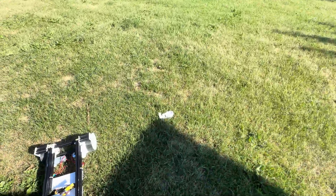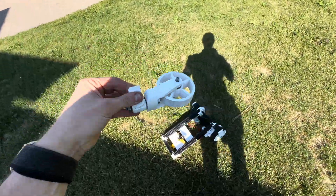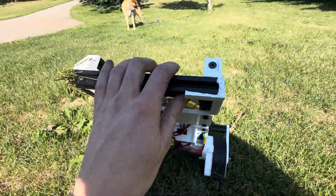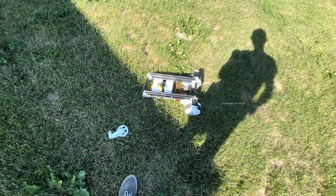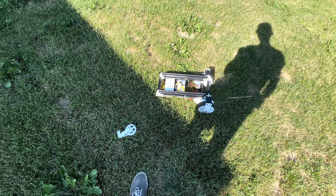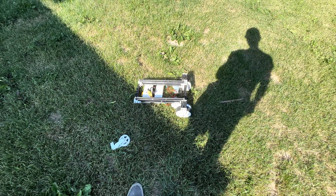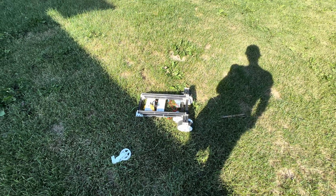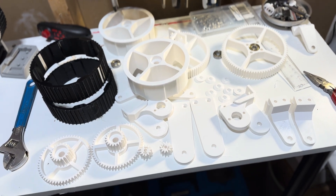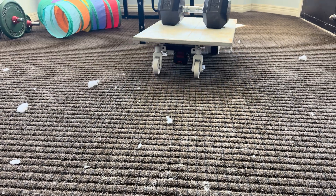I think I found a weak point in my design — it didn't have enough torque to drive loaded over rough terrain. So to add more gear reduction, I added a second stage. I had to print out a bunch of parts, and once I got those printed, I assembled the cart with the two-stage gear reduction.